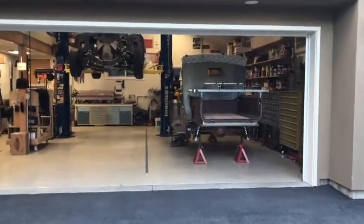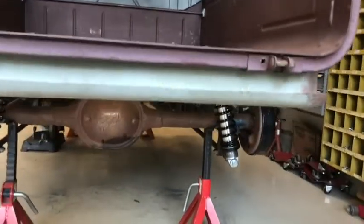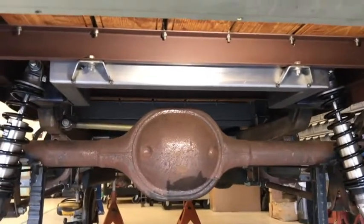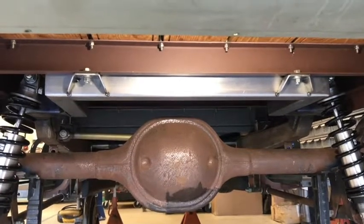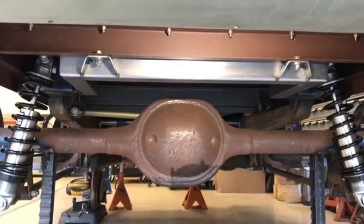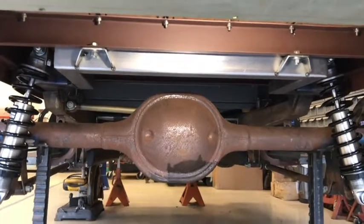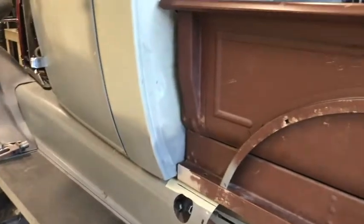Hello there, welcome back to Blue Heinz Garage. We've worked here over the weekend and got a few things done. There you see the final outcome of moving that chassis crossmember back and making the new rear bed mounts. See the two brackets? The bolts are going up into the bed crossmember. They're tacked — not finish welded yet — but they're made and tacked, ready to finish weld when the whole chassis gets finished welded. And we've got these attached, so those are in place permanently. Not finished, but permanently in place. The one on the other side is done too.